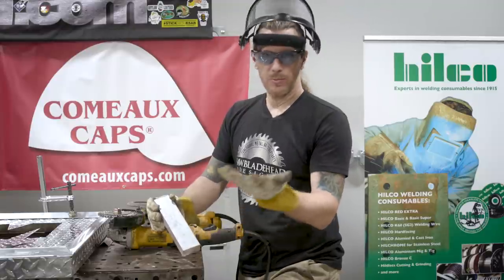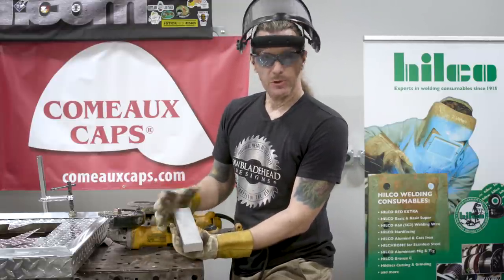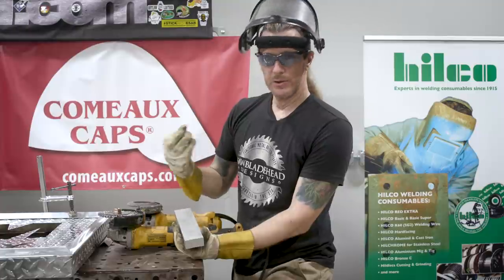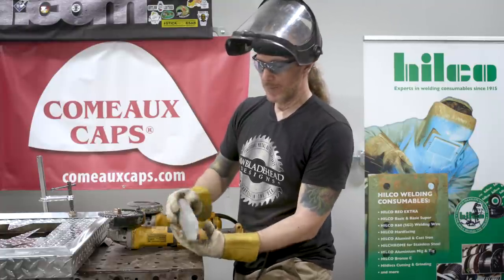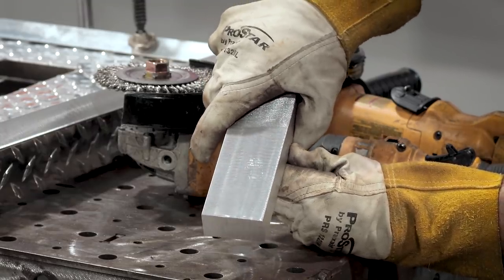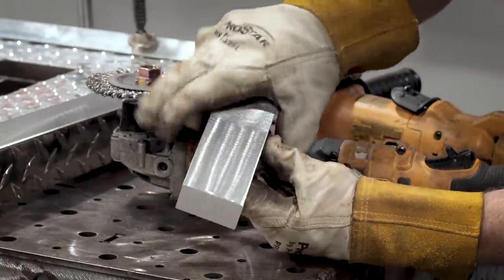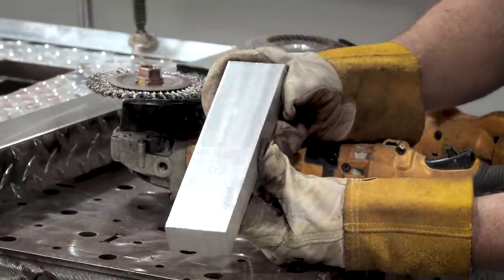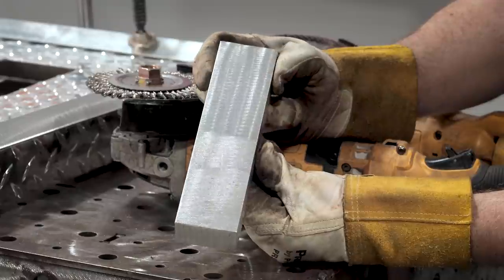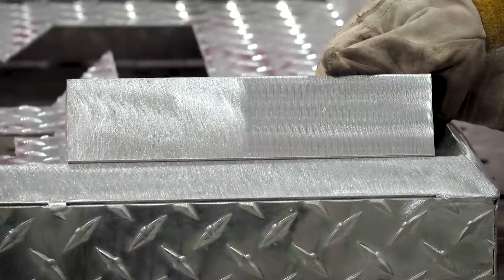Here's a simple technique: when you're polishing or sanding metal and you want a different look than the typical brushed look, I call it a satin or muted look. I used a wire flap wheel on part of this, then I take a wire wheel and hit it lightly, and I get this rough, satiny type of texture. As you can see, you get two different looks — a more polished brushed look, or a more muted satin look.